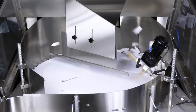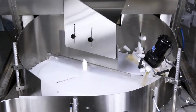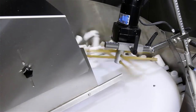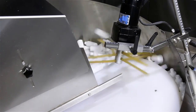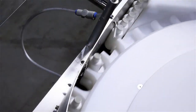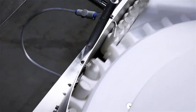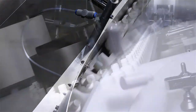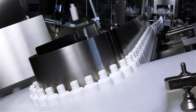The Belsort 100 utilizes a compact operator-level sorting star wheel segmented into three segments to ensure ease of disassembly and lightweight changeover. The sorting star wheel pockets encourage bottles to fall in the desired orientation. A sensor ejects bottles out of the pockets when presented in the wrong orientation. Bottles exit the star wheel single file and in the correct orientation for subsequent steps.